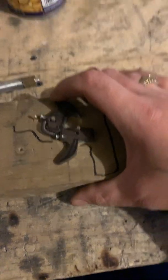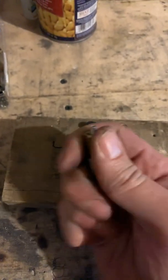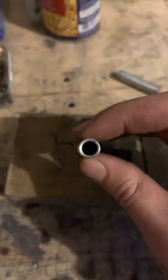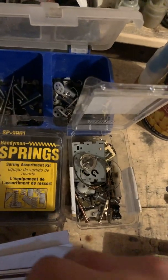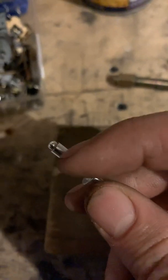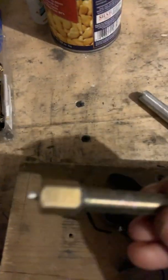It's a pretty simple design and I thought it would be good for the percussion cap pistol I'm building. This is the barrel I'm using — basically it is a hollow bolt with a nut, washer, and the top of one of these nail caps. I took the nail out, cut it down, and sanded it around on a sander to make it fit a percussion cap.